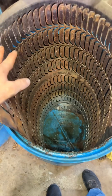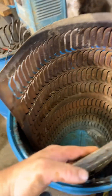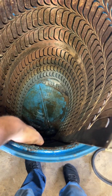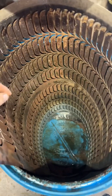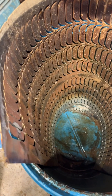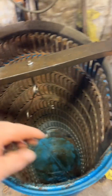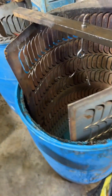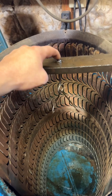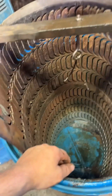You don't need anything fancy — it's just going to get disgusting. What I've done is taken a sheet of steel, bent it as hard as I could, and slid it down in. It's okay that this side's not covered. If you do have a full sheet, do that. I'm just going to use this until it's gone. We're going to put a board right on top — super simple with a hook, just like I've always done. Your board goes on top, your negative cable goes on, your adjustable eyelet, and then you've got a hook of some sort to suspend whatever it is you're cleaning.